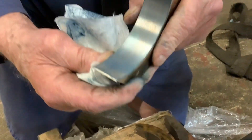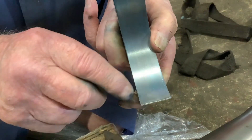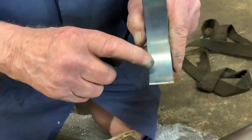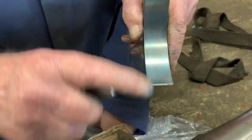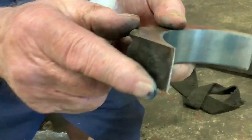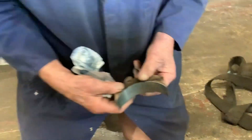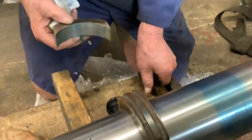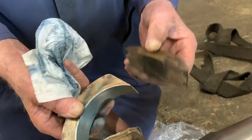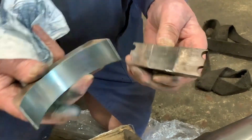Now what we've got there, we've got a heavy mark there, and not so heavy there, but there's a bit of blue there. And then it wants a scrape down towards this end — we don't want that if there's a wrench sticking out like that. Otherwise, where it runs up against just part of this, not this here which is the locator, it won't get the closure yet. You've got to try and have a good joint here, so it's a good steam seal.